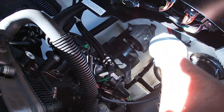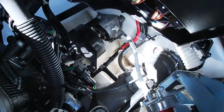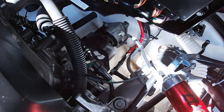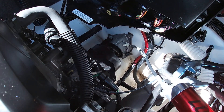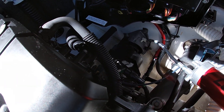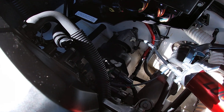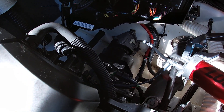I'm being careful because I don't want to break this seal. The little bit of grease on here is okay — this thing is going to be kind of hard to take off and that's how it should be. When I'm done I'll wipe all that up, put the covers back on, start the engine, and run the propellers to see if the noise has quieted down. My plan is to run it this season, and when I winterize it at the end of the season, if it's still making that noise badly, I'll take it apart and replace the bearings.